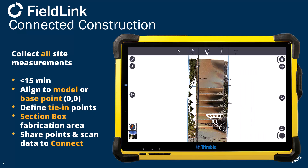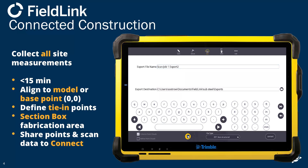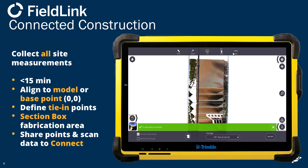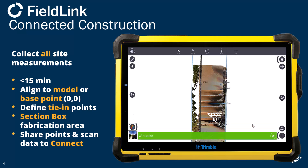Then I'd want to export this scan data to Tekla as a non-gridded E57. If I was going to AutoCAD, Revit, or any Autodesk program, I'd use an RCP, but for Tekla I'll use an E57 non-structured. It's a very quick, pretty small file format. I'd also want to export the DWG of all those points so I can bring those in as well. That's also very easy to export, and then load both up either to Connect or to my thumb drive.